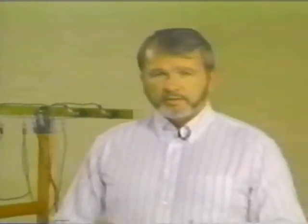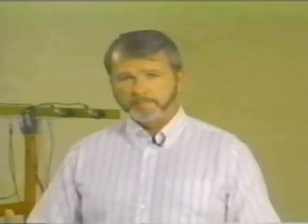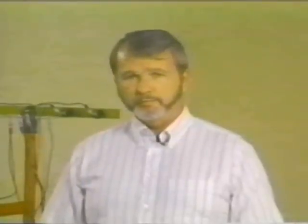Ultimately, it comes down to this. If there is a difference in potential between two surfaces, and you're bridging those two surfaces with your body, if one of those two surfaces becomes hot, a voltage will be impressed across you. And where there is a voltage drop, there will be an accompanying current flow. And if you remember the chart that you saw earlier in this presentation, it requires an incredibly small amount of current for a very short time to produce catastrophic results.